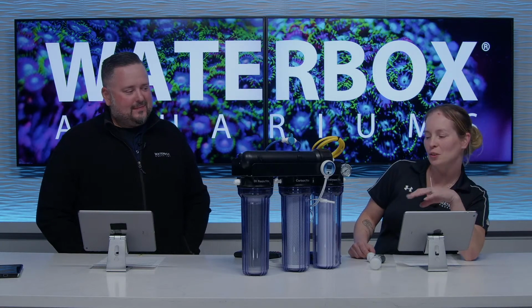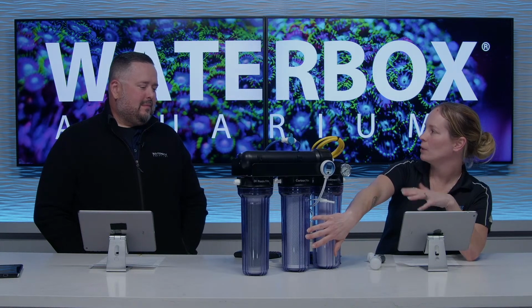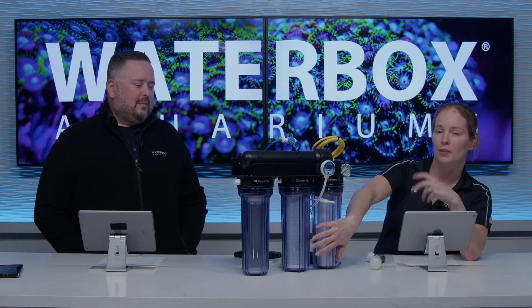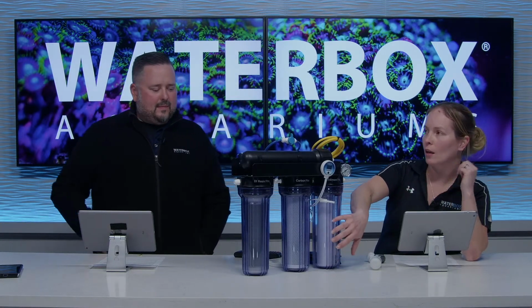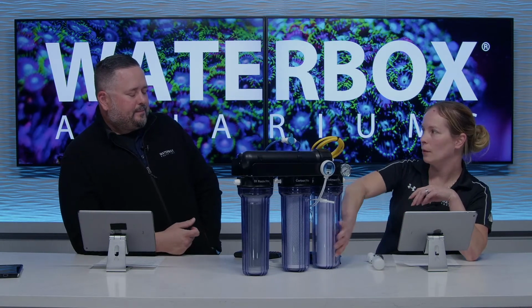General rule, if you have a small tank, these 2 filters probably change every 4 or 5 months. They do have a gallon rating, but I don't think anyone's going to sit there and calculate exactly how many gallons have gone through. Just as a rule, for a larger tank, I recommend every 2 to 3 months. If you make a whole bunch of water, probably once a month just to be safe.